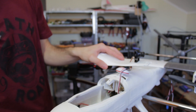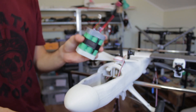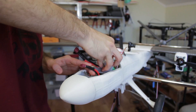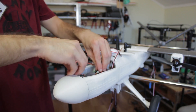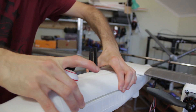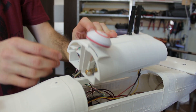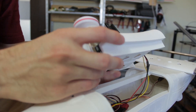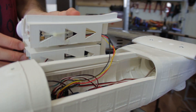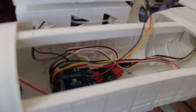This here in front is the battery compartment, which also houses the camera. This is supposed to fit a couple of lithium-ion packs — those are also handmade, one in the front and one slightly behind it. Here we have the housing for the video transmitter, the control receiver, and the GPS. Inside we can see the Matek F722 flight controller, which is supposed to run all our autonomous flying needs.